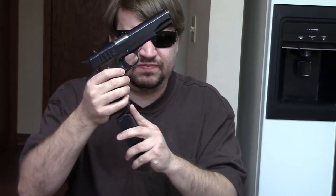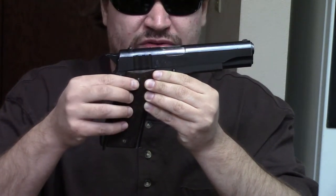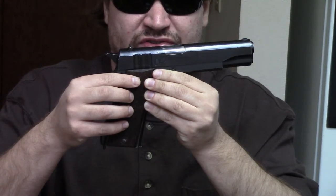It is essentially a 1911 — it uses the same 7-shot magazines, and the barrels are very similar and actually pretty well interchangeable. But the details are different. These are two ounces heavier and just a smidge longer than the 1911 because of some simplifications they made. Most notably, the slide serrations are larger with finer serrations in the middle — they remind me of those found on the earlier Russian Tokarev TT-30 and TT-33 pistols — and they were a little faster to machine compared to the many fine serrations on the Colt and the Sistema.